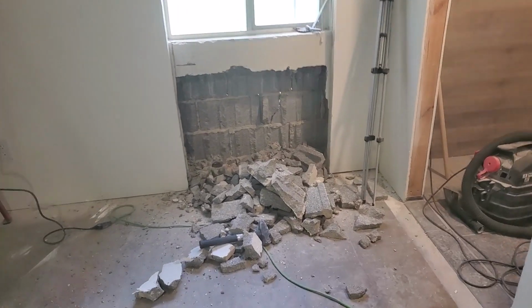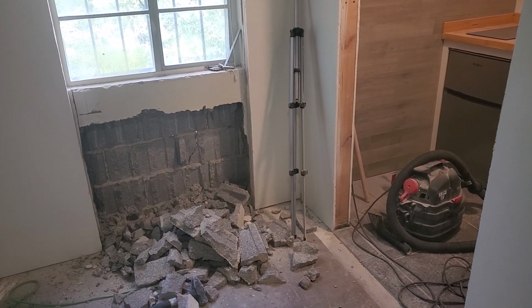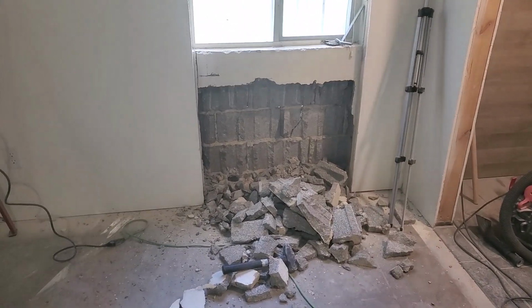But I started breaking out, and you can see a little bit of light. And some of those pieces, I can just push them and they will fall over. So tomorrow's when I'm gonna have the whole day, I'm gonna go to the outside and cut the cement block with the stone blade. Sorry, I'm missing words today. Then I'll be able to do a nice cut opening, take out the window, and install the new door. It shouldn't take very long.